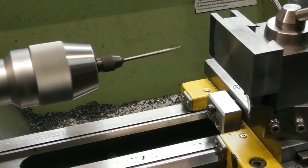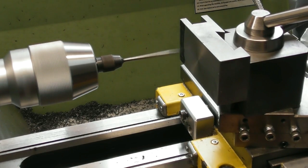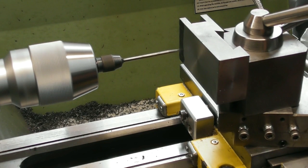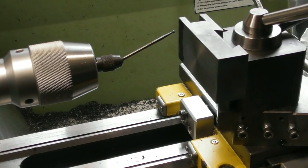Just to show, the sticky pin I use today, I do have a wobbler, or a wibbler, or a centre finder, edge finder, what are we going to call it? I've always just called it a wobbler. I'll just wind in nearly closer. Whoop, there we go. It's a 2.5 mil ball on that one.